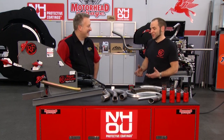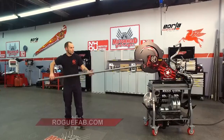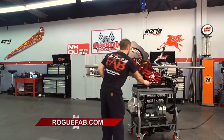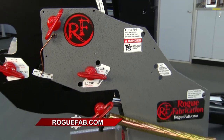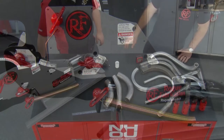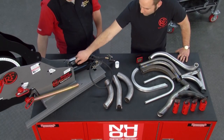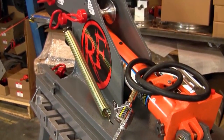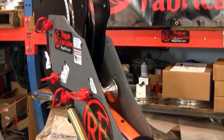So we came out with the M600 and that was in 2012, and it checked all the boxes. This is basically our entry-level model, the M600. It's got an inch and a quarter diameter die in it right now. It's air over hydraulic, so it's powered by your air compressor — you can also pump it with hand power if you don't have compressed air. This machine is a weld-together kit, shipped anywhere in the U.S. with the die, and it's under $1,000. Extremely affordable.